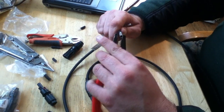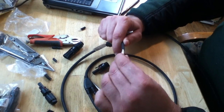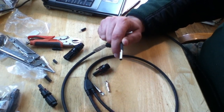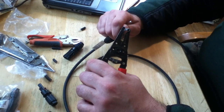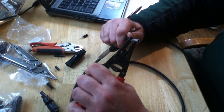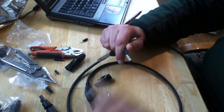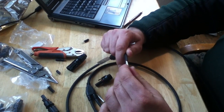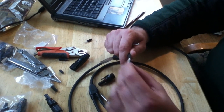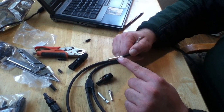What we're trying to do is make that wire turn just a little bit so it's really nice and firm. If you get any wiggle, give it a good little twist again and bring the tab down a little bit — don't use the cutting edge. Try to get it to where there's no wiggle at all. Lack of wiggle means you're going to have a higher quality connection.